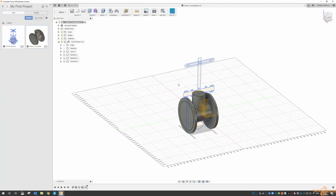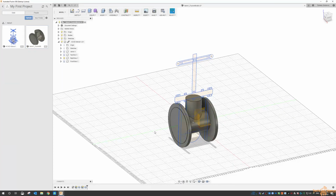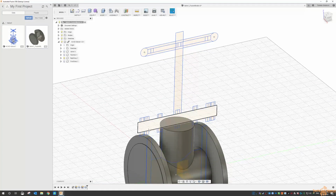Building up custom parts in Fusion 360, and then we're going to send them out to Plant3D CATS and Spec Editor, put it in a library, and then use these parts inside Plant3D. Now, yesterday I did the main body of the valve, and today I'm just going to do this top half here. In real life that would probably be a mating flange. So I guess this would probably be the top part of the body, and then possibly the operator might be connecting to it.